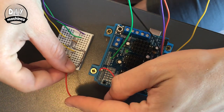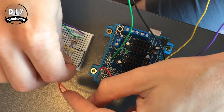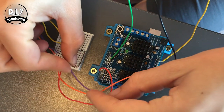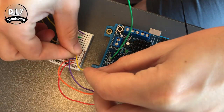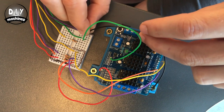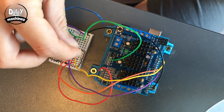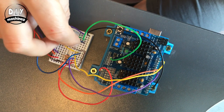The first thing we'll do is match up the wires for the LED. In my case, they're matching colours, so take the wires from digital 9, digital 10, analog 1, and ground, and match them to their equivalent colours on the breadboard. Connect the 5 volts to the centre wire on the contact switch. Digital pin number 2 is then connected to the bottom wire on the switch, and an additional wire is used to connect the 10 kilo ohm resistor to the ground that's already on our breadboard.